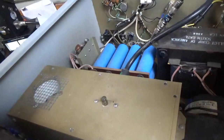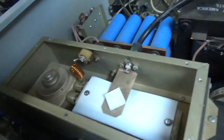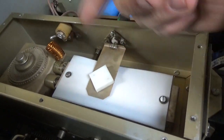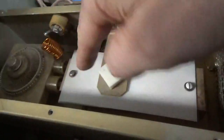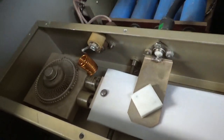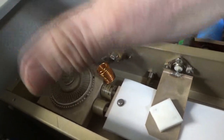Cover's off — I'll show you what I did. This is the adjustment I was talking about. I adjusted it per the manual's instruction. Basically, it's just a screw that pushes down on a Teflon piece — essentially a capacitor between the strip line and the output connector. For this adjustment, there's a flapper thing underneath the ground potential, another cap that moves up and down between the strip line piece. This tube is a pain to get out and a pain to line up with the pins, but it's in — with the bent pins straightened out.